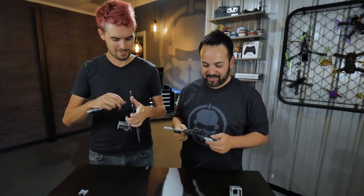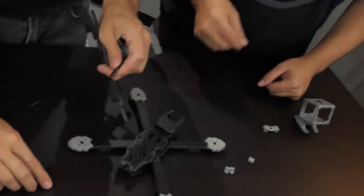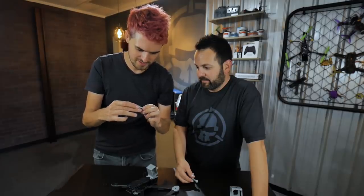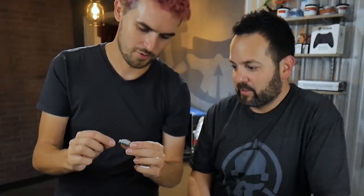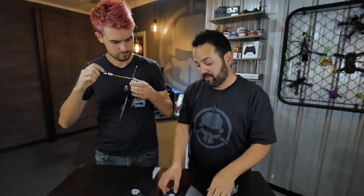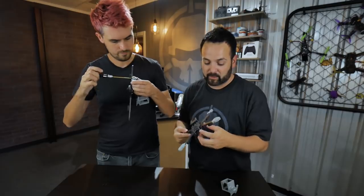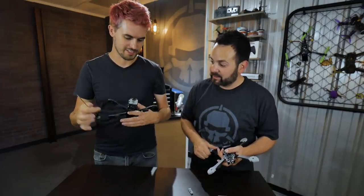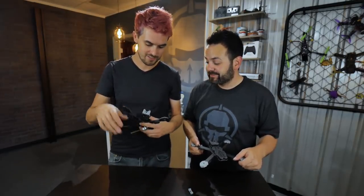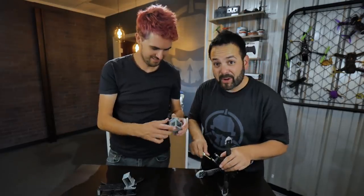For the antenna mount, take the standoffs all the way out after you've assembled it. There are two holes for your 2.4GHz antennas and antenna tubes or zip ties however you want to protect them, and a hole for the SMA connector - if you have the style of SMA that has two holes on the side you can bolt it in. The 3D printed parts aren't required - you can figure out some way to mount an antenna without them. There are places for a strap, but I really like using a 3D printed piece that gets the antennas away from the carbon fiber for best range.